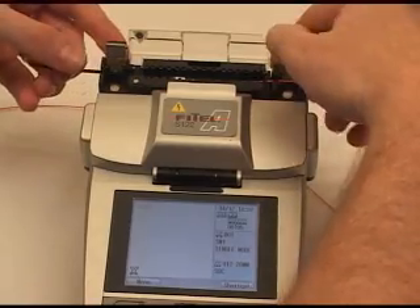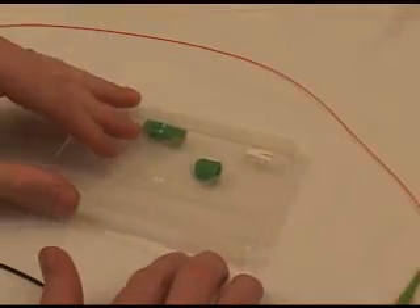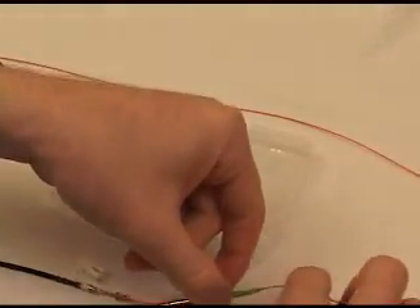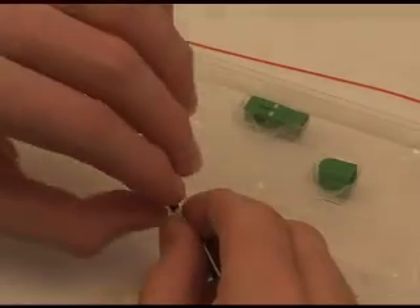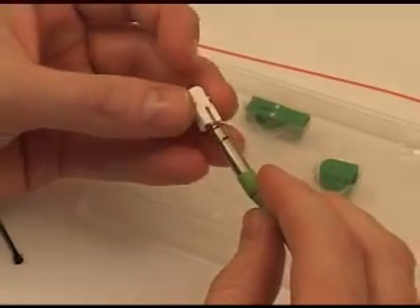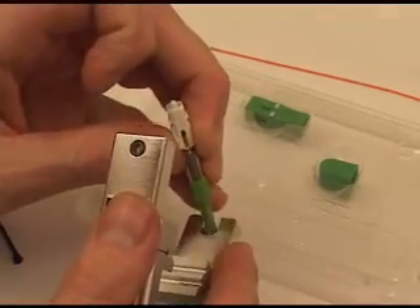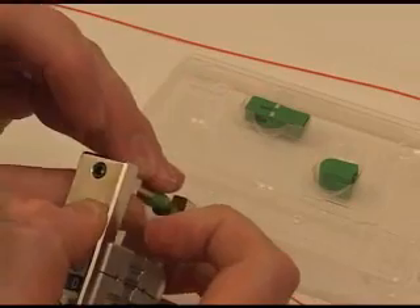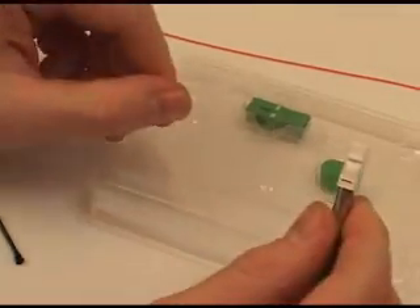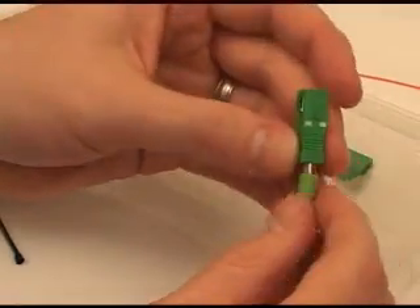Open the oven and remove the finished splice with the splicing cover permanently bonded to the splice. From the parts tray, remove the inner housing. Slide the loose parts on the 900 micron fiber into position directly onto the connector body. Now separate the factory polished ferrule from the transportation holder. Attach the inner housing over the ferrule and connector body, and use the connector assembly tool to firmly lock it in position — you will hear a distinctive click. Now remove the outer housing from the parts tray and snap it over the inner housing — again you'll hear a distinctive click.